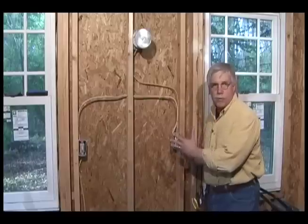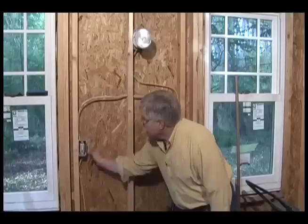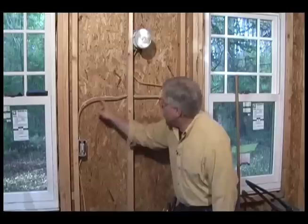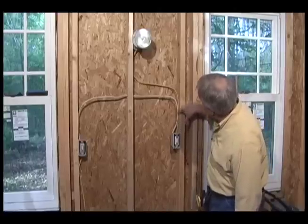I've built this little demonstration of three-way switches in my garden shed so you can see how they work. You'll never find two three-way switches this close together in real life, but here's how they work. Look down here — you'll find this yellow wire. This is where the power comes into the first three-way switch. There's a white wire that leaves this switch and drops down into the second switch box. Out of that switch box is another yellow wire that goes up and feeds the light.